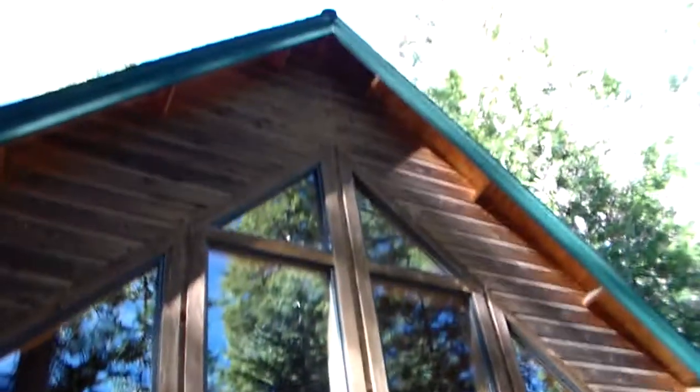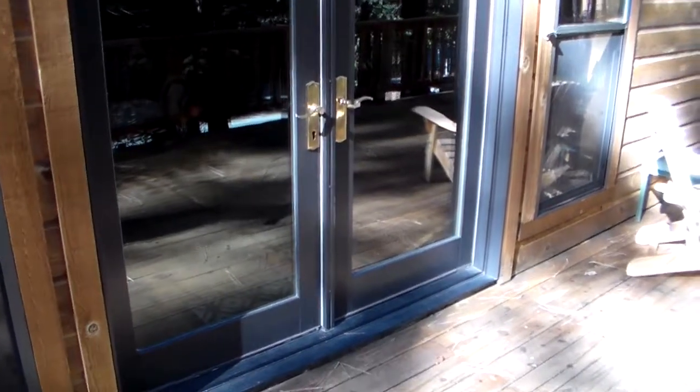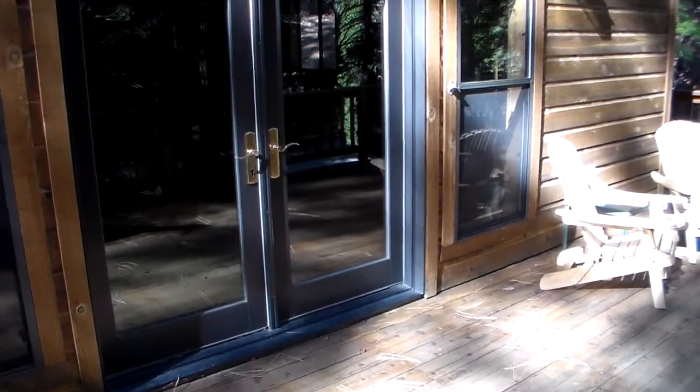We bleach the walls out and try to get an even medium finish. See that little crease in the fascia — there's an opening there. Stuff like that we caulk before we paint. Prep is very, very important. Those two boards — the one-by and the two-by-eight fascia — have to be caulked to keep water out. All lights will be removed, windows masked with film — not paper, nothing that'll leak. These doors will be the same thing. I really like that color — I would almost suggest we try to find that color and use it for the other doors too.